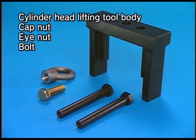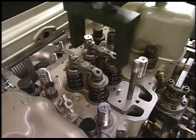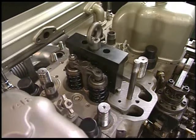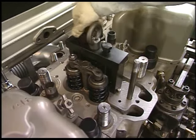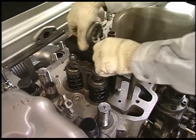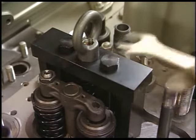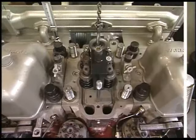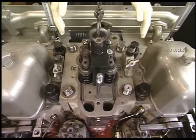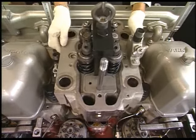The cylinder head is removed by using the exclusive lifting tool. Firstly, fix the lifting tool to the tightening bolts of fuel valve. After fixing, put the crane and lift up vertically with care not to damage the screw of cylinder head bolt.